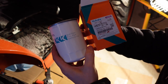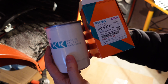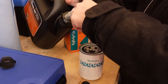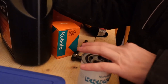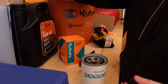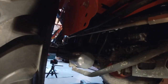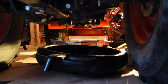I wanted to get a shot of the part number — this is the suction filter, the longest of the three, and it goes on the right hand side underneath the operator seat. When changing these filters, you're supposed to take a little bit of fresh oil and put it around on the O-rings to give yourself a good seal and help them come off better on the next service. Here's a shot of the long filter — I've confirmed it's the same size — and now I'm going to start to change it.